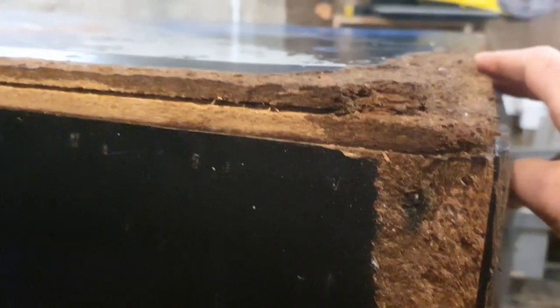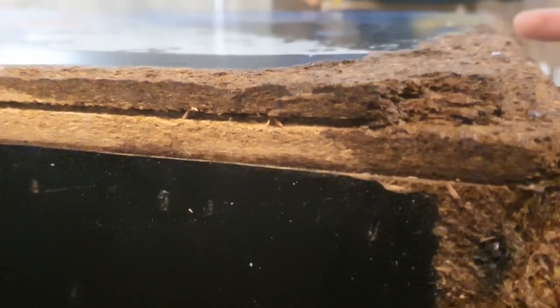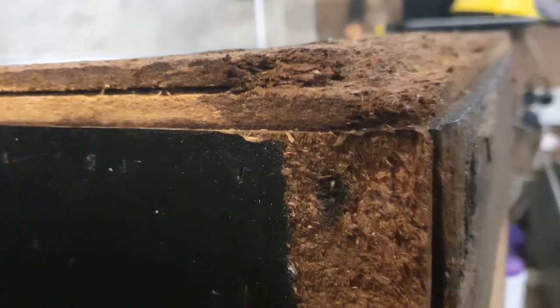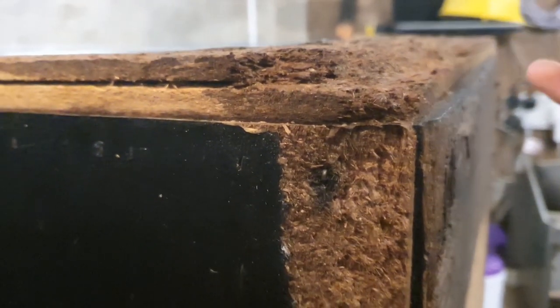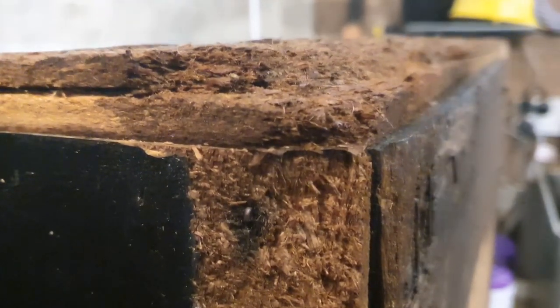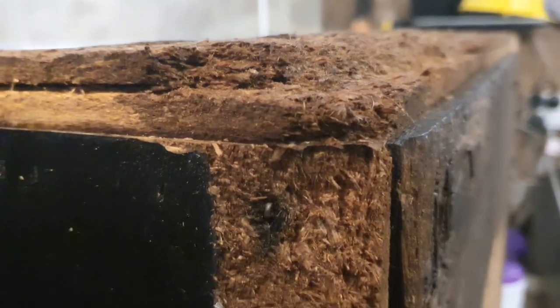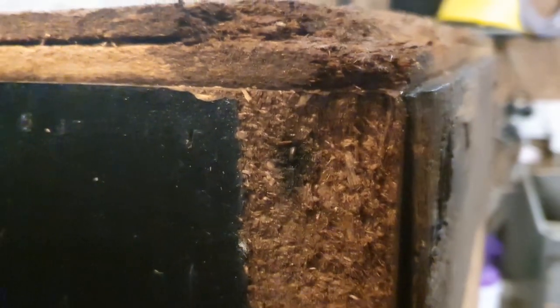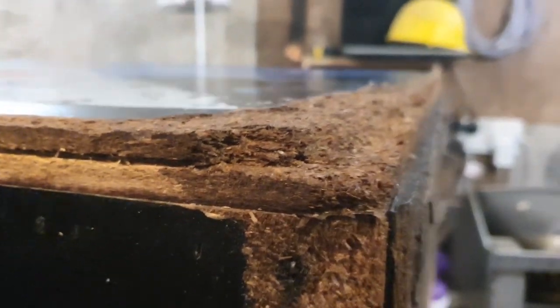it gets more exposed to things. So to reinforce this area, I'm going to put small tiny nails here, all the way here. I want to be careful not to put them this way, because here I need to redo the T-molding at some point. If I do that and then I cut the nails, well, that's the whole point of putting the nails. I'm going to put them this way, all the way here. And it'll provide a bit of a structural bond as well between the fiber and the wood.